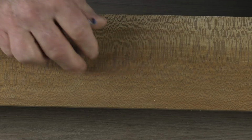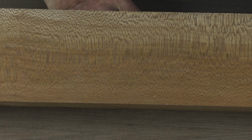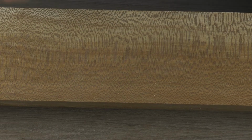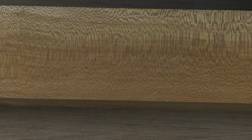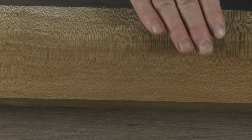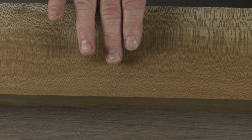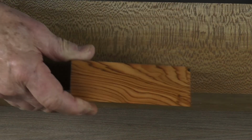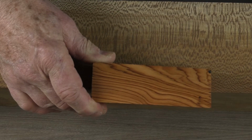It would just mix in with all the light and shadow. So we're looking at something that has an amorphous sort of pattern. Bird's eye maple is perfect, I think, that sort of thing. If you go to Turner's, Wood Turner Supplies, you can often find Turner's use very interesting woods. We're going to polish this, so we do want a pattern. We're going to, you know, sand it, make it smooth, so we'll see this pattern. But what we don't want is a pattern like that goes under, so it goes across the folds. So lots of choices, but that's the sort of thing you're looking for.